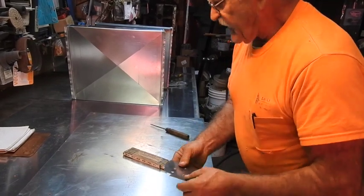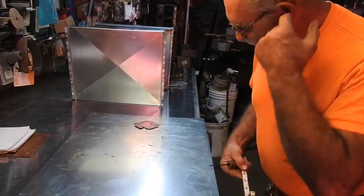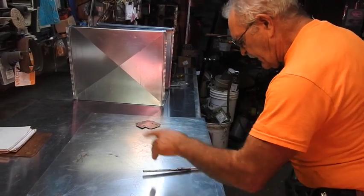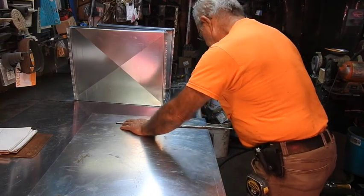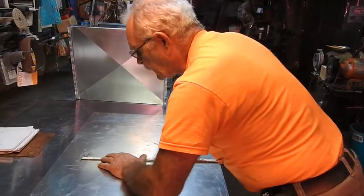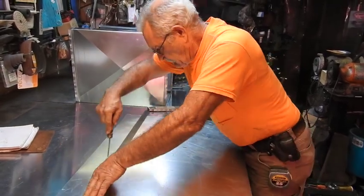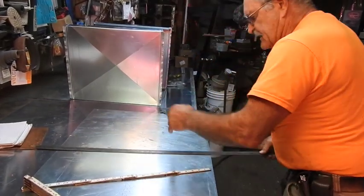We know we have to have a quarter inch up the sides and a quarter inch across the bottom, and this is 17 and a half inches deep, so we're going to be 17 and three quarters from the outside edge. We're going to be 18 inches high plus the quarter inch, so 18 and a quarter. We may as well mark it for both pieces since they're both coming out of this — so it's 18 and a quarter plus two and a half. We'll cut the length for both of them at the same time and mark 17 and a half on this one also. The cut size is 18, remember.